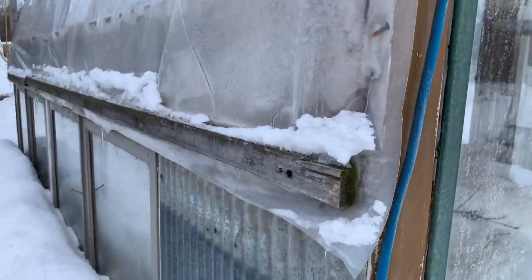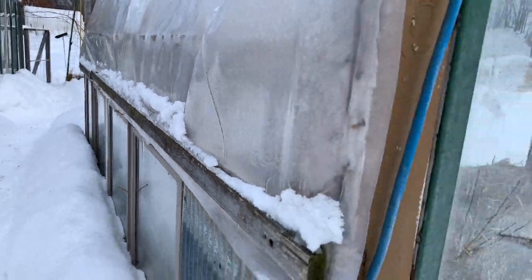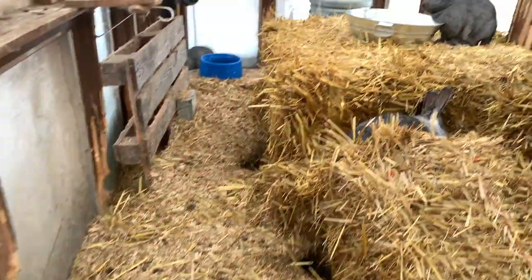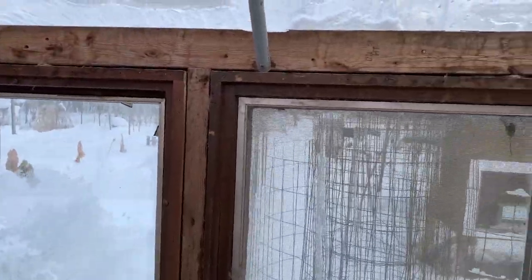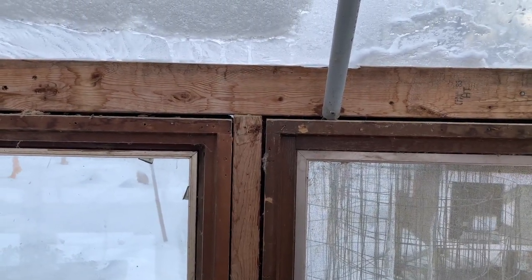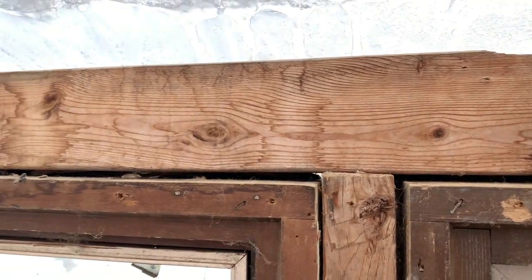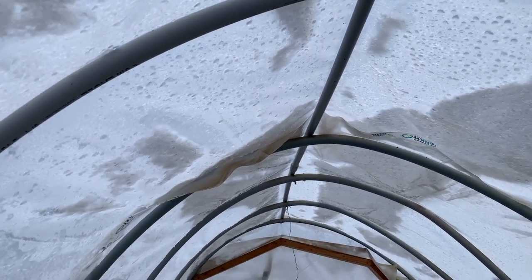Since I have you guys, I thought I would show you the rabbit hutch as well — again, all just stuff that we've gotten from people that were throwing things away or from the dump. Just a lot of reclaimed windows and tin. I wanted to show a different application, a different setup, but again just utilizing the scraps you have. These old timbers, a basic stud with a header running across — which is two 2x4s screwed together — and then you have PVC exterior-grade conduit, which I think is made to be buried, so it's actually UV resistant. That's probably the conduit and the poly are the only things I bought on this build.